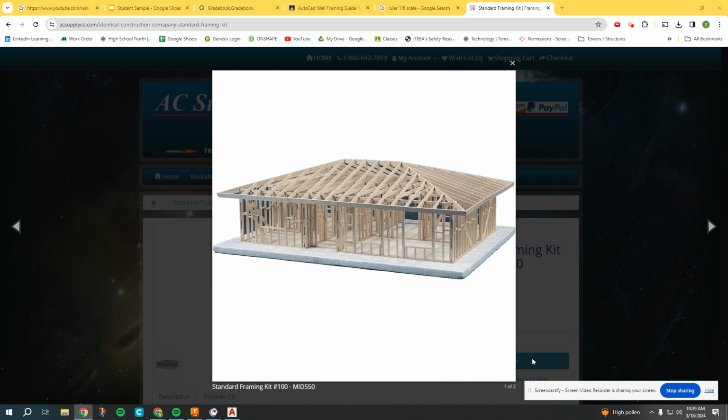This is going to give everybody mostly a chance to orient themselves with CAD while learning the terminology and parts of the walls and home on the inside, the skeletal parts. And we're going to build this thing up to the ceiling trusses. I'm sorry, ceiling joists, which are the horizontal pieces laying across the ceiling. We're not going to put the actual roof on this, but we'll go up to the ceiling joists with the plan, and I'll show you how it's done.